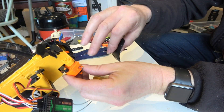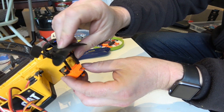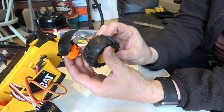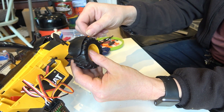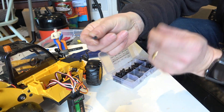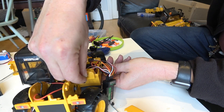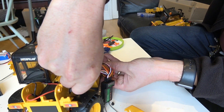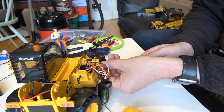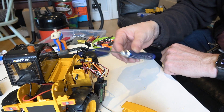Put the wheel arch back on. One thing I've noticed is that when this is on it actually helps hold the motor in even better, which was something I didn't think of during the design. Put the wheel on. We're going to need a couple of machine bolts — this one is 12 millimetres and this one is 4 millimetres. The longer one goes in the back. Over time these will loosen up, but having tapped them we've got somewhere to start. With my other one they're actually hand-loose now so I can put the cover on and off without tools, but for the first few times I used a tool.